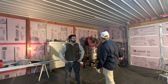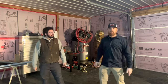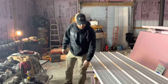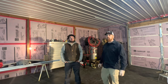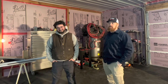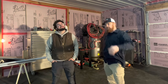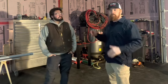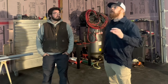We measured our trusses and they happen to be four foot on center. So instead of getting eight-foot exactly cut sheet metal, we went and got it customized and cut eight foot two inches from our local Amish. We cut it eight foot two inches so we had a little bit of an overlap, able to slide the metal underneath to give it a better look. Having a four-foot span between screw points for our sheet metal is okay with the rigid metal we're using.